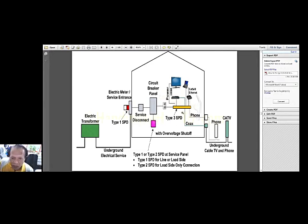Okay, and of course this is an extension outlet where your desktops, laptops, and other electronic devices are also connected. So this was the outlet that I was mentioning to you with a surge protective device. So that's sometimes the way we protect this very sensitive equipment. So if you do not have this surge protective device, chances are when there is a lightning surge coming from outside, you might be damaging your sensitive electronic devices. Okay.